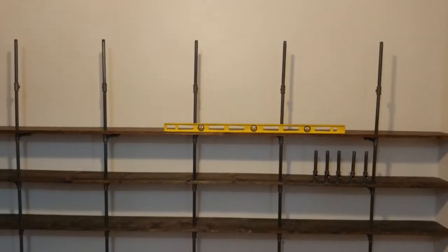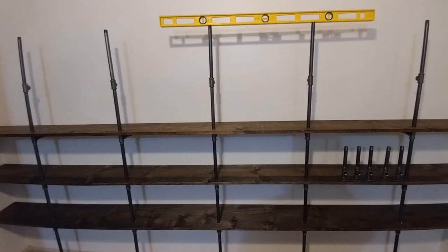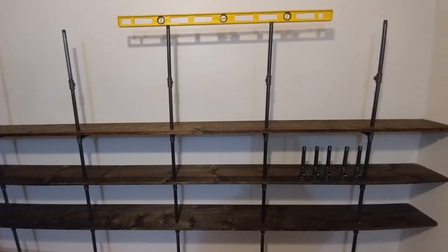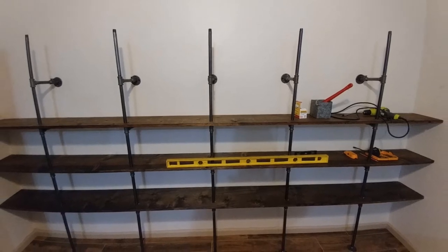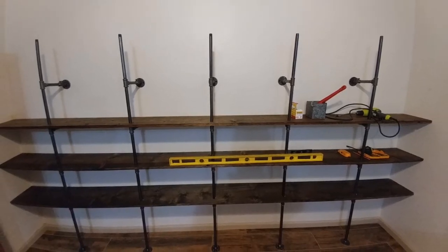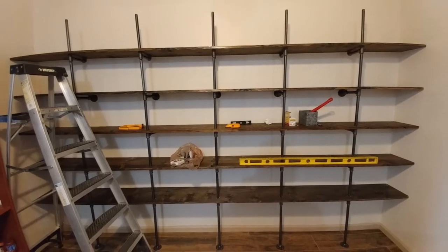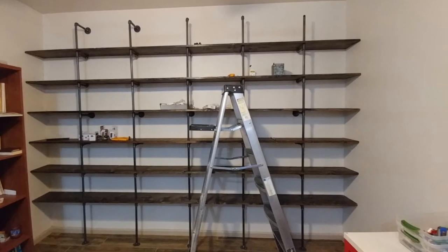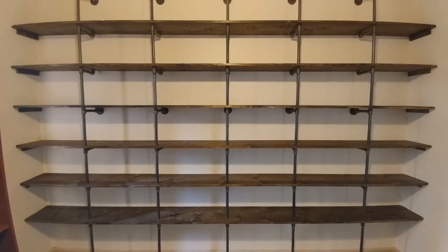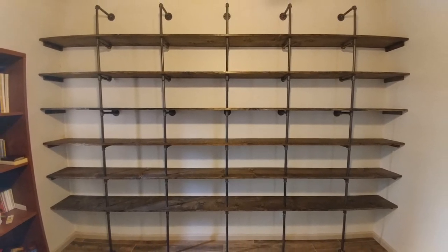With each level, I have to make sure everything is perfectly level, all the angles are right, to make sure all the boards when they go on are completely flat. There are three spots — one at the bottom, one in the middle, and one at the top — on each section of bars where I'm attaching it to the studs to anchor it to the wall. I also used the leftover pieces of wood on each end of the board to make sure the ends don't sag.